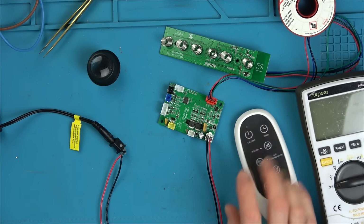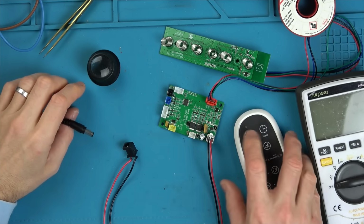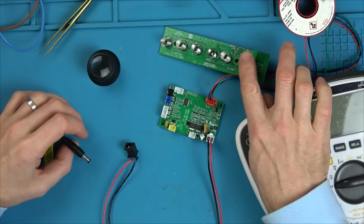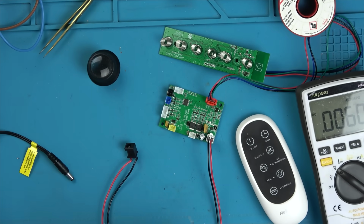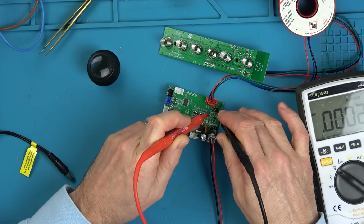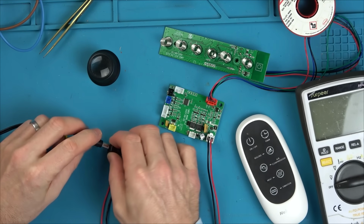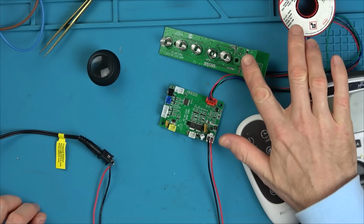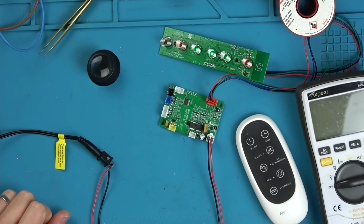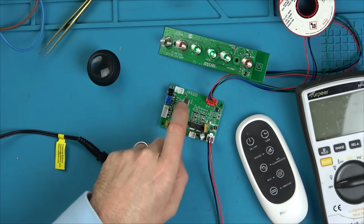Yes, let's do that. So I have had this before on an Xbox Series S. I connected up my bench power supply at 12 volts, and all of a sudden it was like a beep on, beep off, and all of a sudden, boom, it just worked. And then when I went back to the original power supply, it just worked after that. Really, really weird. And a lot of people said that there must have been some kind of tiny short on the board, and by connecting your bench power supply, maybe it wasn't as sensitive as turning off as the main power supply, and it just started to work.